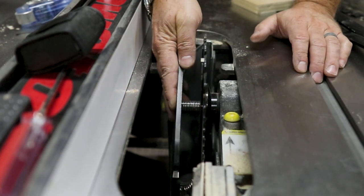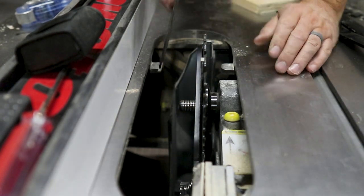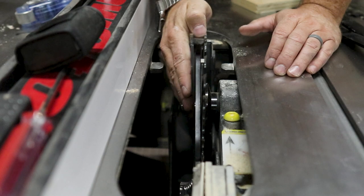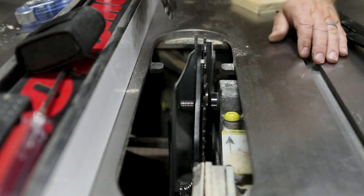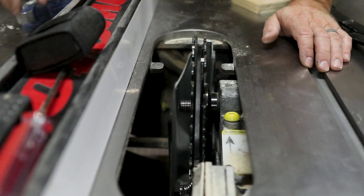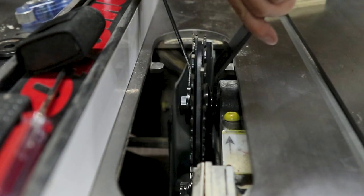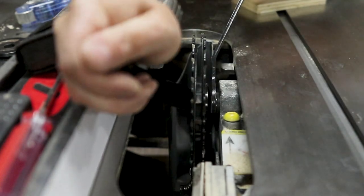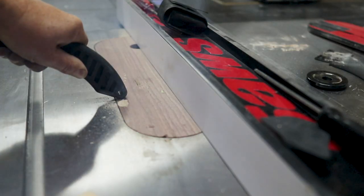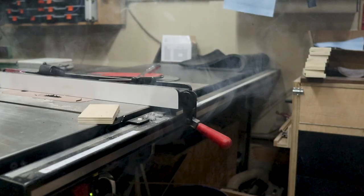I always make sure that I rotate all my pieces at least 30 degrees to each other, because you really don't want any of the teeth to touch. When you start tightening everything down, you could damage the teeth of the blades, and you want the saw blade to be as balanced as possible. Since this was the first time using my SawStop with the dado stack blade, I did have to make a zero clearance faceplate.